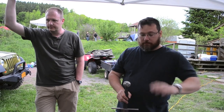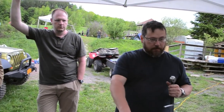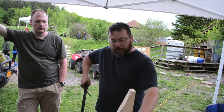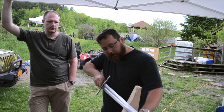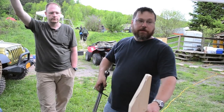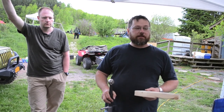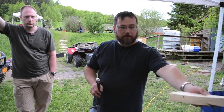Question about the angle guide — on some swords you've got a diamond cross-section, so if you only match one edge of the diamond, that's a completely different angle. You want to find where it's pretty much level. The whole point is consistency. If you're at 42 degrees, the end of the world? No — your edge will just be slightly different. If you're at 65 degrees, then you've got problems. Now you all know how to sharpen swords.